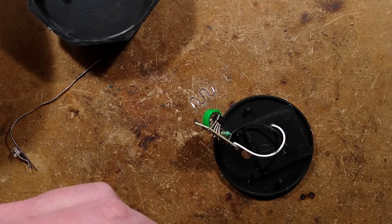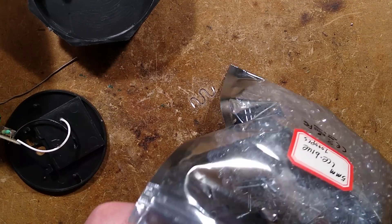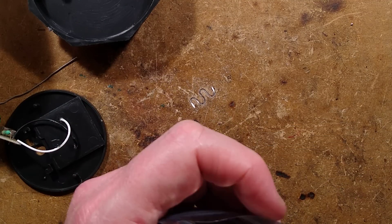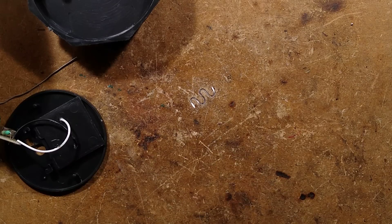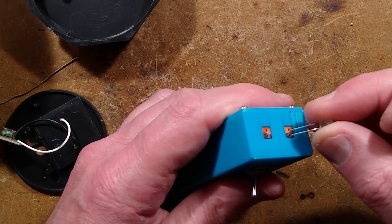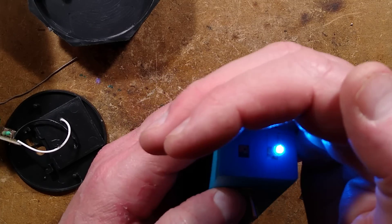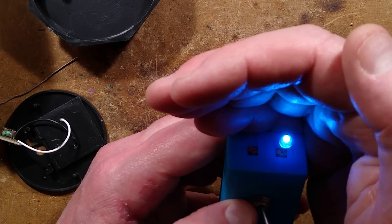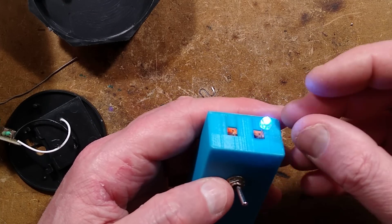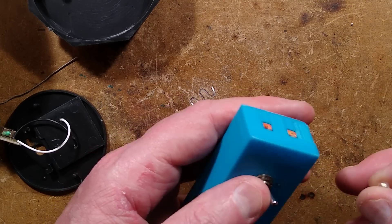The LED I'm going to put in is an ice blue LED — I have 1000 of them and nothing better to do with them. Here's my little LED. When I turn it on it's a nice bright icy blue. It's basically a blue chip with a little dusting of white phosphor, just barely — it's almost like a white LED, but with so little phosphor that it just makes a pastel blue. It reminds me of Uranus — which is indeed an icy blue planet.